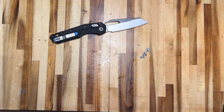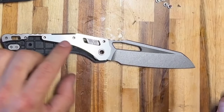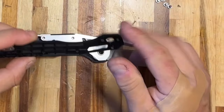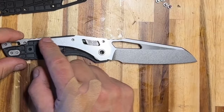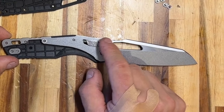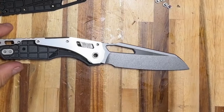I wanted to see why this knife unlocked so easily with a massive RAM head that shouldn't have happened. Liners are critical in this design — they connect everything from the blade, moving stresses back toward the back spacer, and then distributing some of them to the scales because there's a recess in the scales that holds everything together. It's akin to the frame on a gun, designed to absorb stresses from front to back. The stress impulse travels from blade to pin, from pin to liner, from liner to back spacer via a second pin. This knife is designed for extremely heavy-duty action, so it's really annoying that it unlocked so easily.